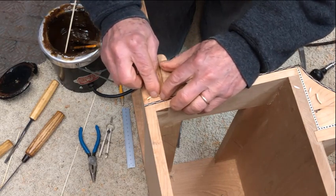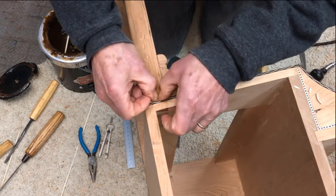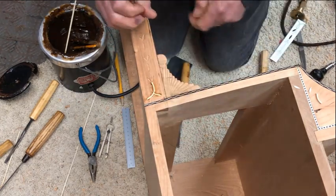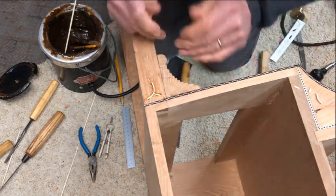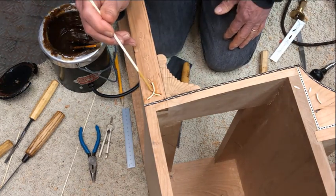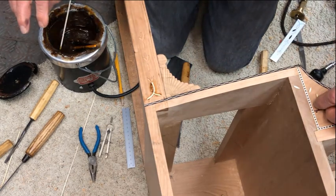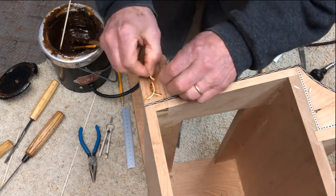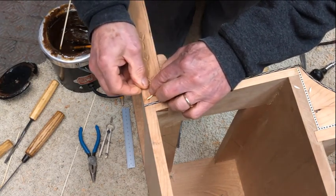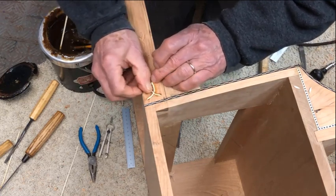And the ends of those little pieces will miter with the vertical length of stringing that goes down parallel to the edges all the way down to the ankle of the leg. And the last piece of arc butts up against that one and force it into the groove.